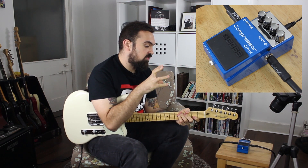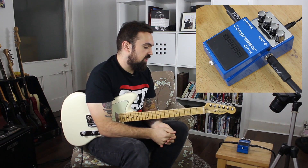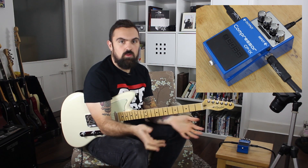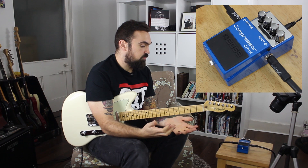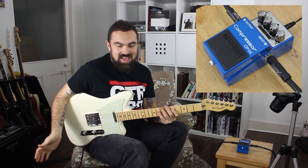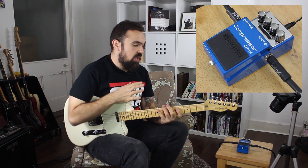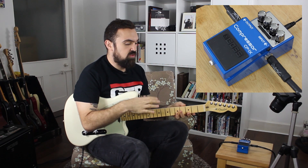This is like a multiband compressor, but the technology inside does something a little bit different. It's a digital compressor rather than an optical or analogue compressor — more like a studio-grade rack mount. What MDP does is analyse the input signal coming from your guitar and applies different amounts of compression or effects to different frequencies.